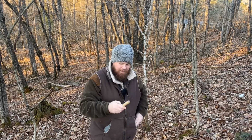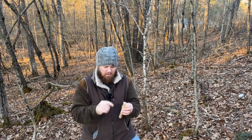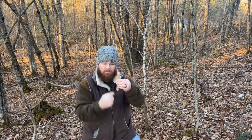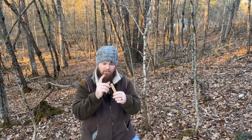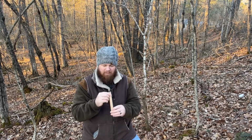So bamboo. The next thing is dowel rods. You've got some decent sized dowel rods like this one right here. Simply cut it about 5 to 6 inches long. Put it in a drill press, center it up, and drill a hole straight all the way through your dowel. You're going to want to make the hole about half of the diameter of the dowel.